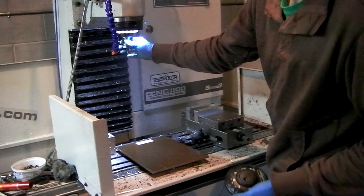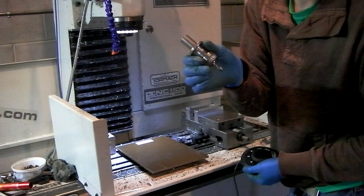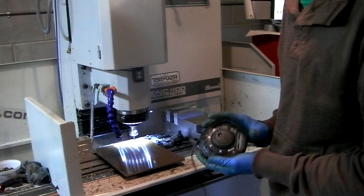So I just need to jog the cutter until it's just to the outside and then cut the outside, and same for this line. So in the spindle here, I've just got a beater end mill I've been using for a while. It's a 2-flute 1/4 inch from Lakeshore. It's got some good chips in it, so I don't really care, but... So let's hit it. I'm just going to use it manually, using the jog pendant here. Turn the spindle on, speed on manually.